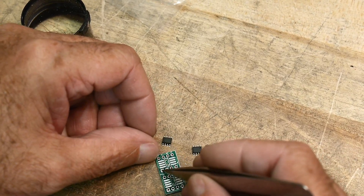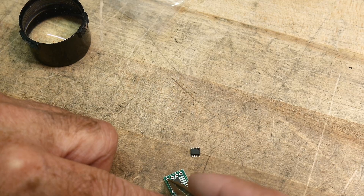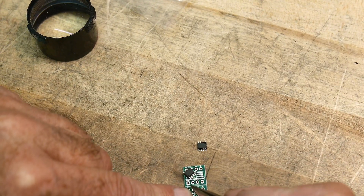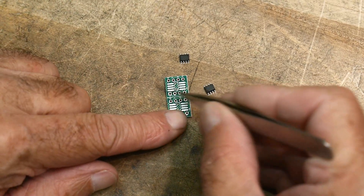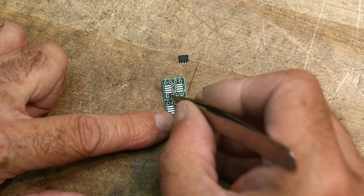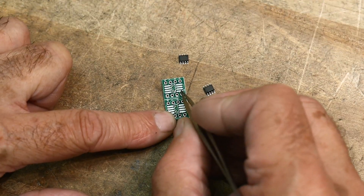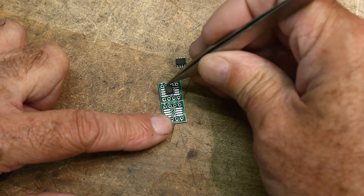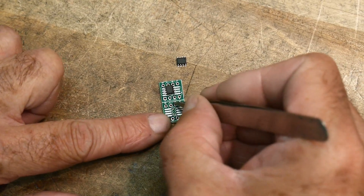So where's pin one here? Pin one is marked there. We will put them on — that goes over here to pin eight. These are laid out funny; you have to be really careful about this. So even though the pin — let me start over. This is the surface mount part and this is going to be the new DIP part. Here's pin one — it's a square hole. But if you look at the routing, pin one routes over to this pin here on the SOT part. This is pin one of the DIP part. So you have to be really careful about how you put this on — it goes on like that. Even though this is pin one, the dot is going to be closer to this other pin. Just kind of be aware of that.